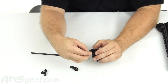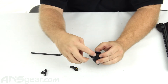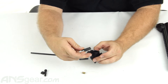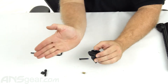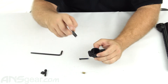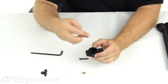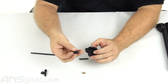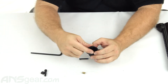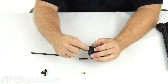The next piece we're going to put on is another collet, but it also acts as the pivot for the lever itself. If we didn't put this little piece in there, there would be no way for the clamp to roll on the elbow and squeeze down on it — you'd just have a lever folding back and forth without applying any pressure. So this piece is very important.